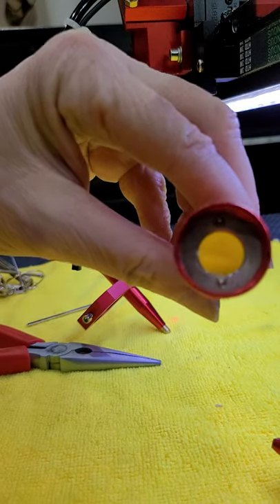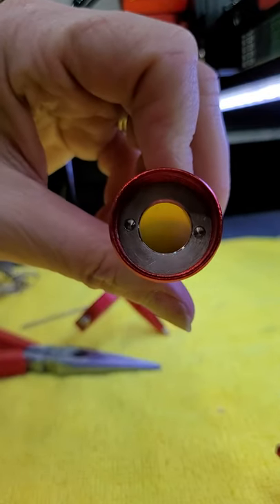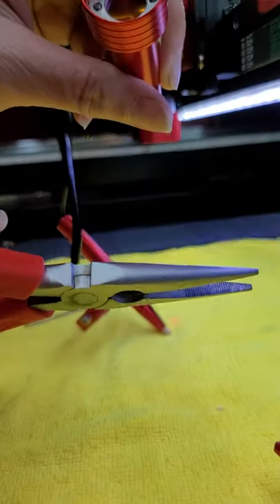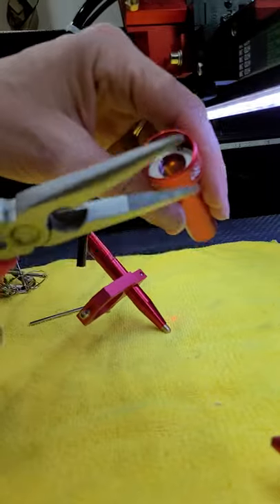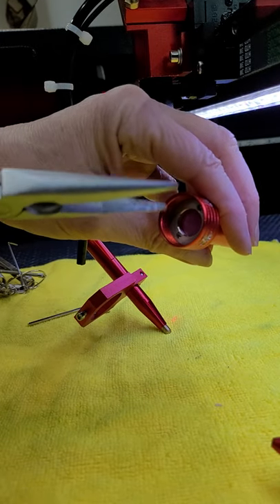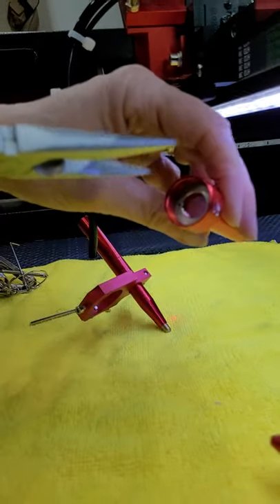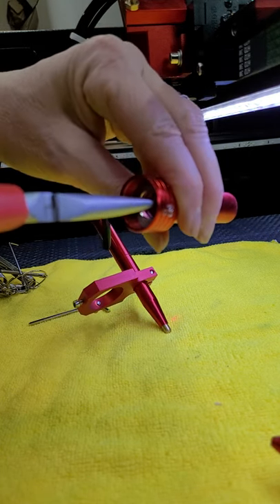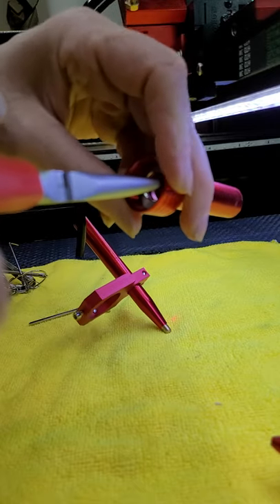In this tube here you might be able to see the two little dimples — they're right now top and bottom. That is the o-ring and you've got to get that off in order to get to the lens. You can actually see the lens on the inside. What you need is a pair of thin-nosed needle nose pliers. They make some other tools for this, but I went and got this pair from Lowe's for $4.67. Be really careful that you do not touch the lens with your needle nose pliers because you can scratch it. Put the tips of your needle nose pliers into those o-ring dimples and then twist the red tube until you can get it off.